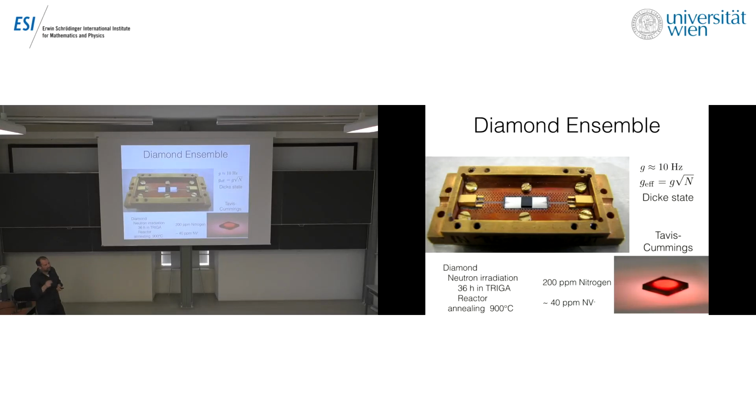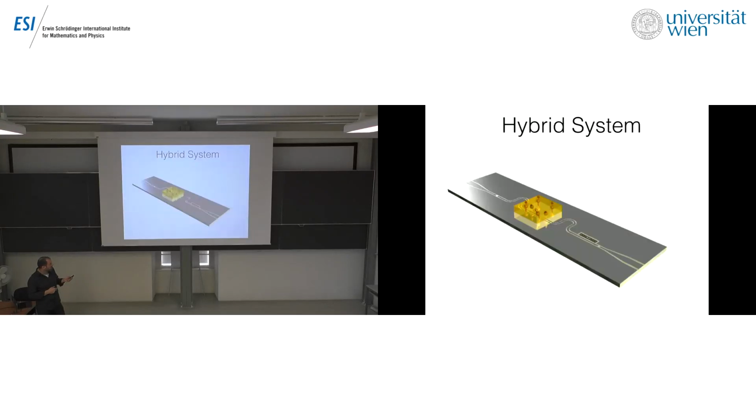One thing I can answer, what we're definitely trying, is lumped element circuits, not transmission line resonators, where we go in with a focused ion beam and make a very narrow superconducting wire in this system, and try to push something there. I mean, the whole fabrication is not going to be so nice. Yeah.